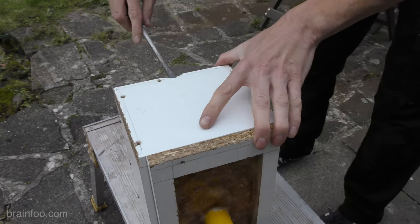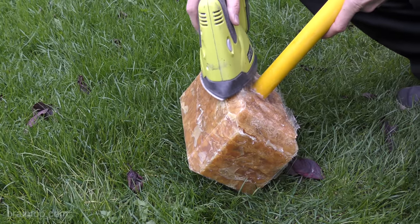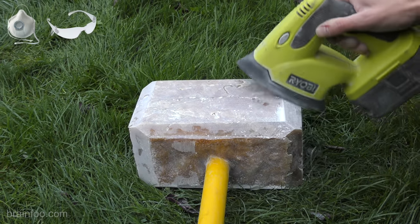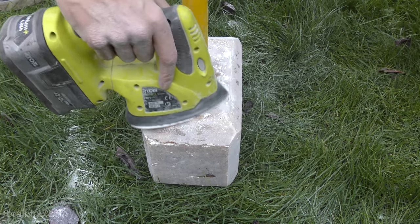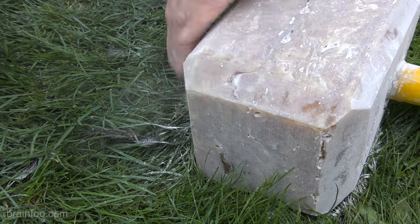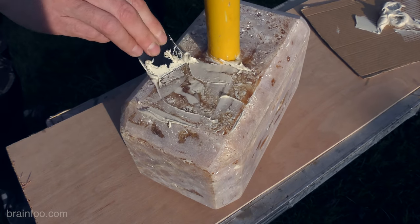It's time for the big reveal — out come the screws, we gently pop it free from the mold, and there you go. She needs a bit of spit and polish but not too bad. To get everything looking as it should, I'm going in with 40 to 60 grade grit paper. Whenever you sand anything, let alone fiberglass, you need a good quality breathing mask, preferably some disposable paper overalls, and the wind blowing away from you. Any angles that were too fiddly to make in the mold earlier can now be sanded into place. Things are now starting to look half decent.